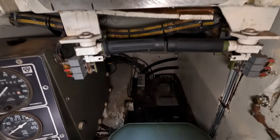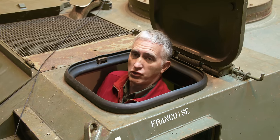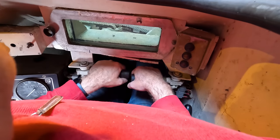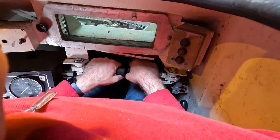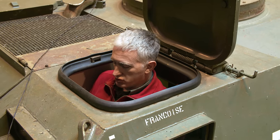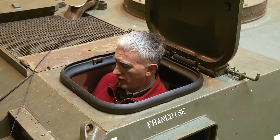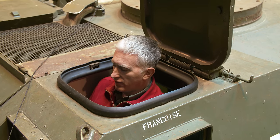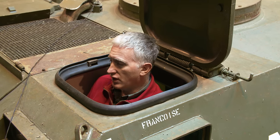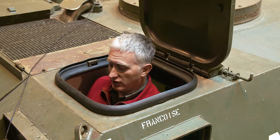To my front I have a single pedal — the accelerator. Under my left foot is a button; nobody seems to know quite what it does — it's like one of those headlight high beam/low beam switches on an old American car. The controls almost remind me of a Jagdpanzer 38T. The steering controls are horizontal and very close together — you pull one, pull the other, pull both to stop. Not a massive range of motion. The steering is hydraulic, so the electricity powers a hydraulic pump. Slow speed steering and testing was found to be very good, but high speed steering was problematic because the small range of motion on the tillers meant you could very easily oversteer or overcompensate.